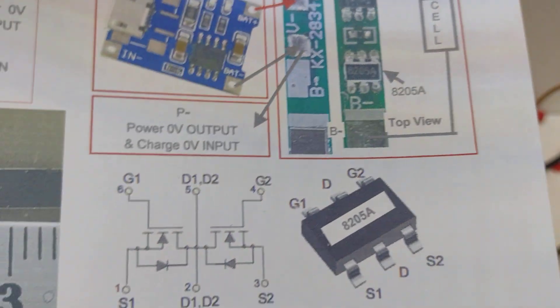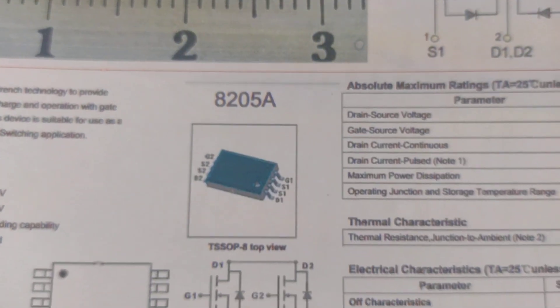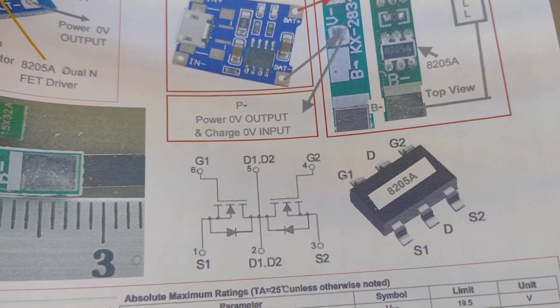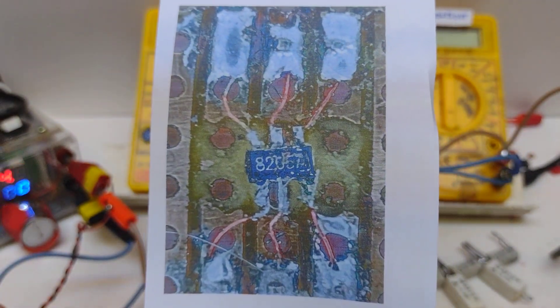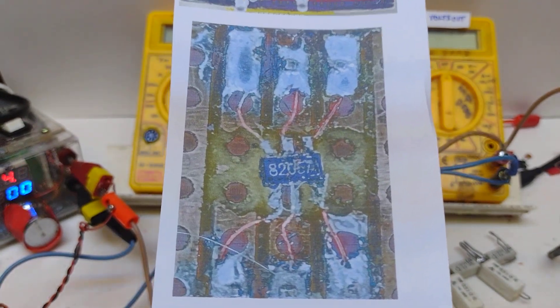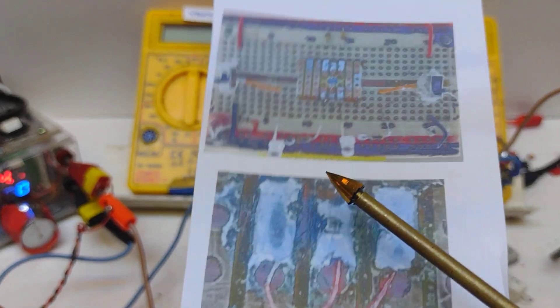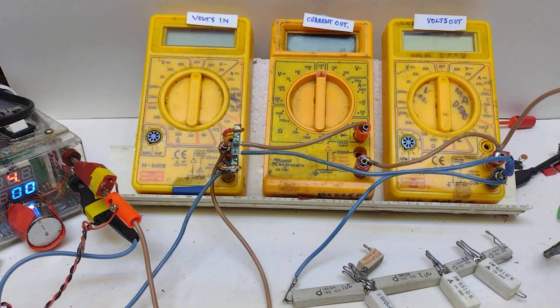As I've said, we've got two sort of setups for this - the 6-pin and the 8-pin versions. I'm looking at the 6-pin version. I've mounted it onto a piece of Veroboard. Used little wires coming off it, soldered onto the legs and then onto the Veroboard. Also on the Veroboard I've got pins going down so that I can put this onto a breadboard.